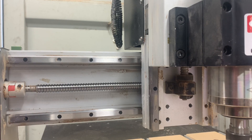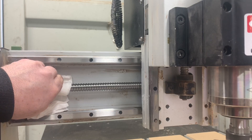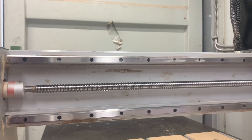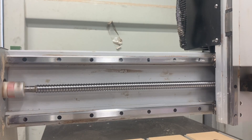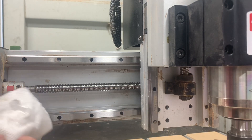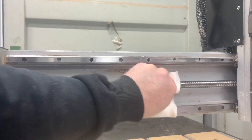Now on the ball screws, I'm just going to take a clean paper towel and hold it on here. The spindle is partway down — I'm just going to jog X-plus and rub it clean, go down to the end, then bring it back all the way to this end. There's plenty of room for safety on the other side. With this little tube of lithium grease — I could use what's in my grease gun as well — on a clean part of the paper towel, just put a little grease on there. Hold it on the ball screw and put a little film of grease on there.